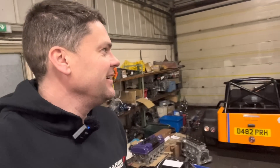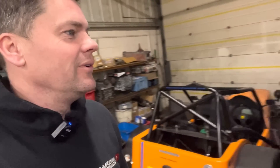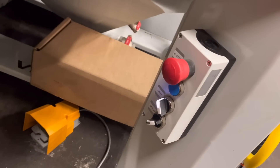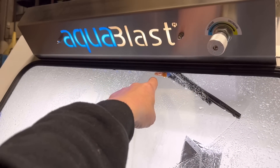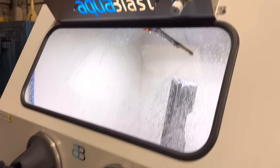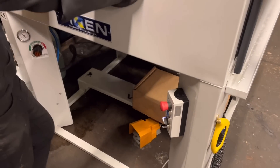Paul is operating the new aqua blast. We managed to figure out yesterday after speaking to customer services how much medium we had to put in it, so we're really happy with it. Paul's doing the BMW sump in there. We'll give you a little run through of how to use it - you've got the control panel down there which turns the LED lights on and the aqua blast logo. This little control here works the pressure in the hose that washes the screen, and the window wiper is activated by the foot pedal.